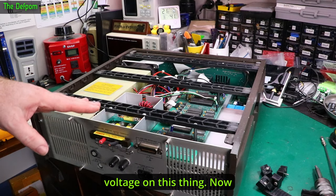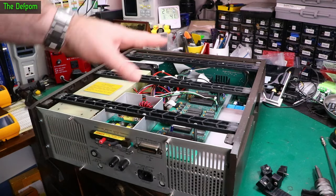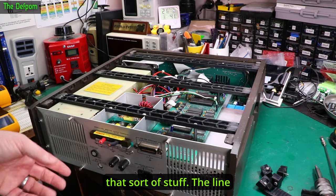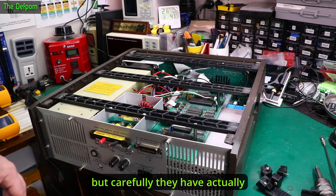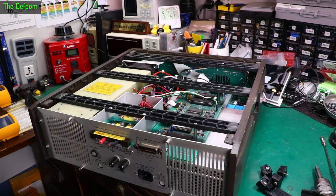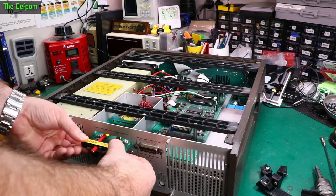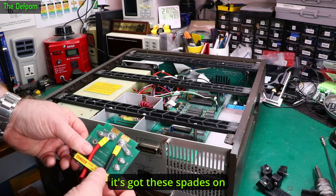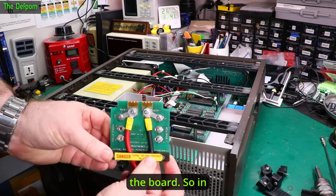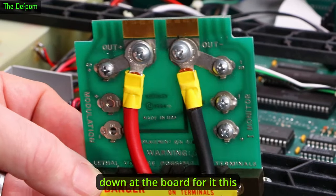So I want to change the line voltage on this thing. Now I've got the thing open and the loose screws out. The line voltage switch is actually under here — it's underneath this assembly. Keithley have actually done a really nice design thing here. You have to pull this card out first, which gets stuck because it's got these spades on here. This is the board — in case everyone needs to know what it looks like, this is it.